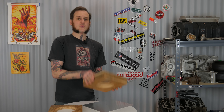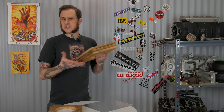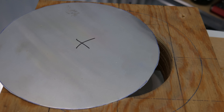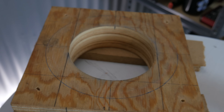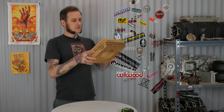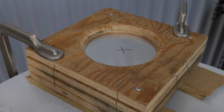To get started we're going to transfer the circle to the blank piece we'll use to create this shape. Our end goal is a round speed blister. If you take a square piece and pound a round hole into the center, the corners will have quite a bit more material at the outside edge than the sides will, and that material is going to have to work harder. So I like to start with a round blank. The speed blister we're creating is a five inch speed blister, so I'm aiming for something around seven to seven and a half inches for my blank circle. You can use a compass or circle templates to create your blank.